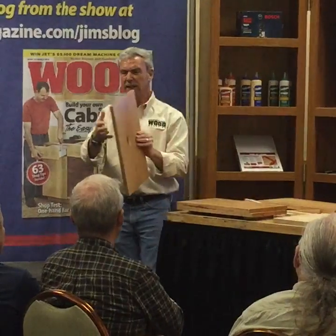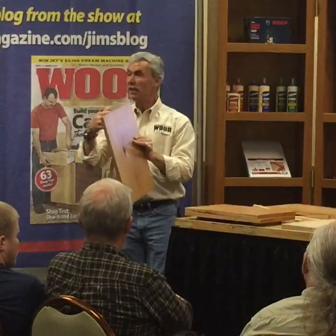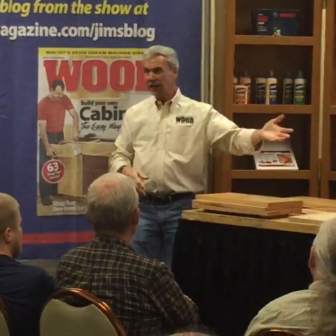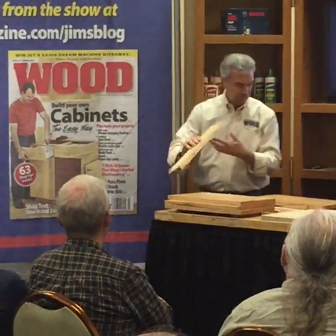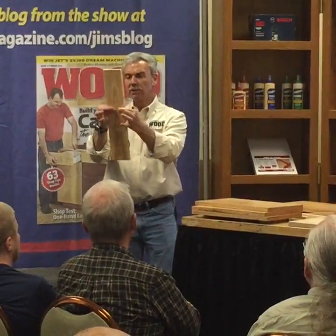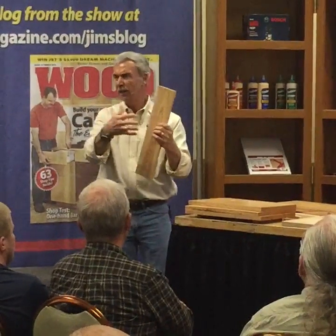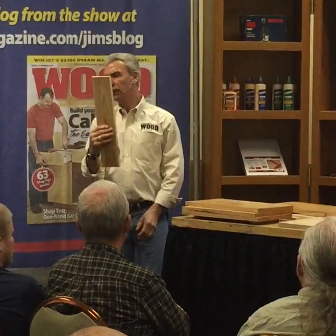But if you look at a 1x10 in relation to its thickness, it's getting a little bit easier to find a flat one. 1x6, maybe a little bit better. But by the time you get down to a 4 or 5 inch wide board, in relation to their thickness, they're pretty flat. If you look at this, that pith part, that curl in the center here, this is pretty irregular right here. But in relation to its thickness, it's pretty regular across its face. So it's going to give in and take off moisture a little slower or faster on the outsides, but it doesn't make any difference because it's doing it over its own width. You're not going to have any problems here.